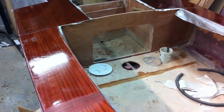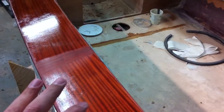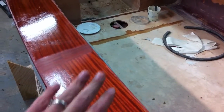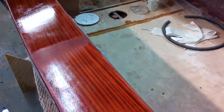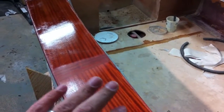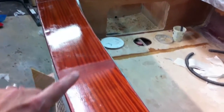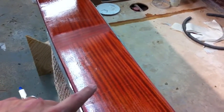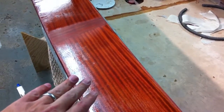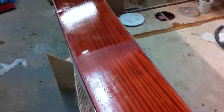So in a bright finish situation like this, you cover the epoxy with a high-gloss varnish — I'm going to be using a product from Epiphanes, just a clear varnish — and that will do a better job of resisting direct sunlight and UV rays. In order to do that, I have to build up enough epoxy surface to wet sand it smooth. Right now with only three coats, if I sand this down I'll hit the cloth because of the dimpling.